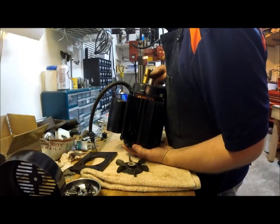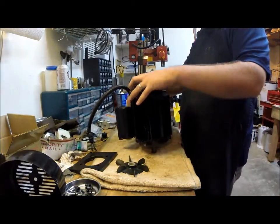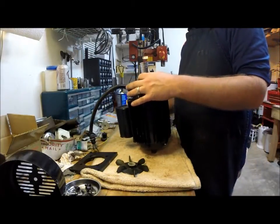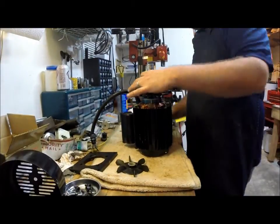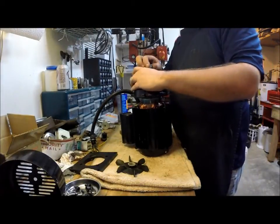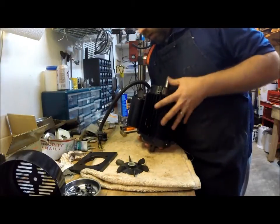All right, before we worry about that, we have to tap this back in. Big socket again. Do the same thing we did earlier. Yep, sliding on that bearing, nice and easy. I think that's fully seated. So, pull this back up. Make sure we've got our alignment.